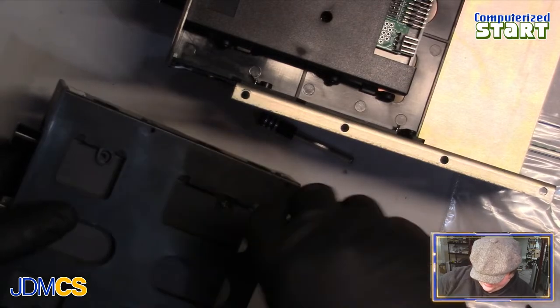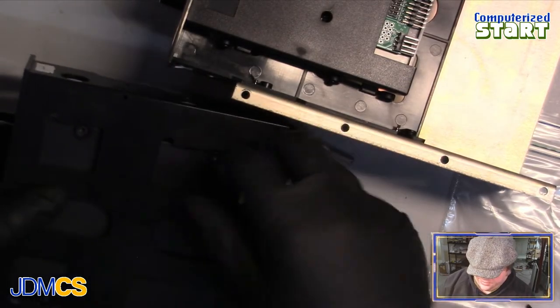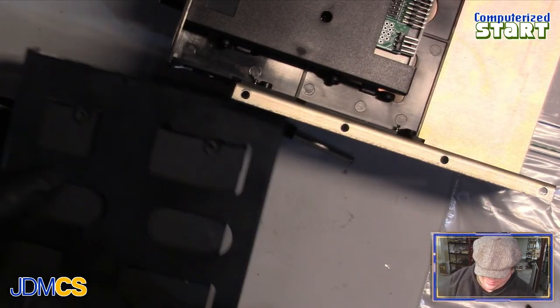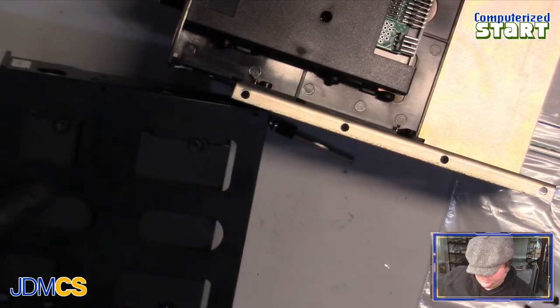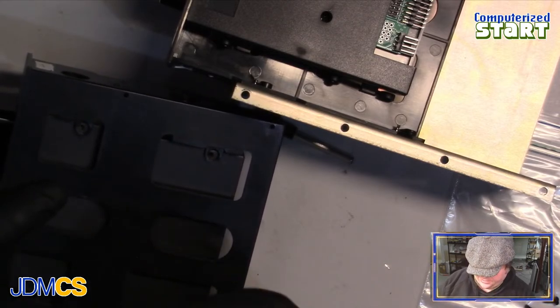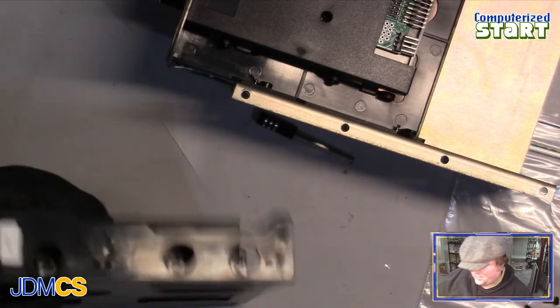Okay, that's why. So anyways, luckily I had a spare motherboard and spare RAM, and the motherboard had 8 SATA channels on it. But the thing is, the motherboard won't fit the case that I had my NAS in, because the motherboard I had on hand was an ATX motherboard, and it was a mini ITX case. So anyways,